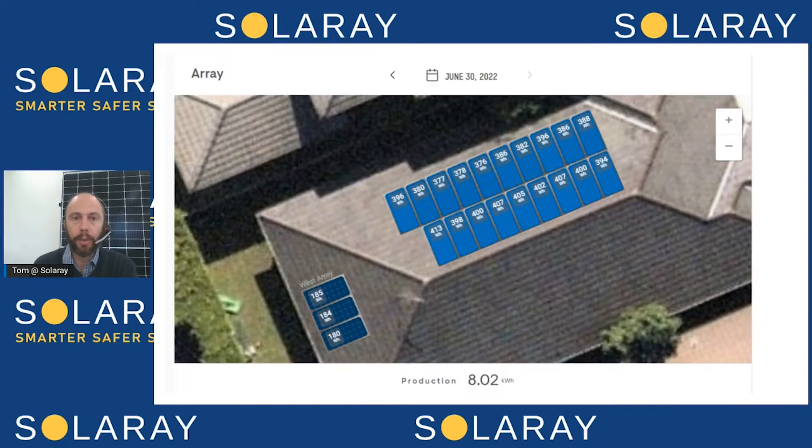The next thing is online monitoring. After the installation, we configure your system in the Enphase Enlighten portal — we match up each panel and put in all the serial numbers so everything's registered properly. You'll get an overview in the monitoring portal like this. Importantly, you can see quite different output for each panel even on the ones all facing north. The great thing about an Enphase system is each panel is independent of the others, whereas on a string system they're hooked up in series and output at the level of the worst-performing panel. You can see a difference from 396 up to 413 watts, and you get the full benefit of that with a microinverter system.